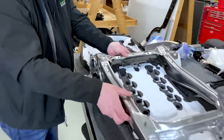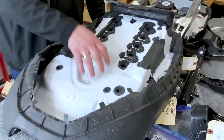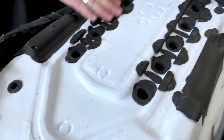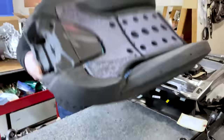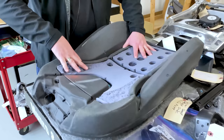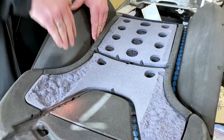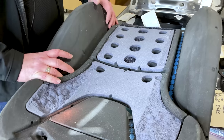Your seat back. So we talked about the structure. Same issue with the foam with the scrim material, but this is a different material. Much more rigid. I would like to know where their reasoning was behind that. It may have been the suspension mat or the lumbar support needing that more rigidity. Your seat cover, your attachments here are Velcro. So those sunk in portions, sometimes they'll have little molded in clips into the foam. You'd snap your cover into the clips. These ones are able to actually grab with Velcro. Quite nice.